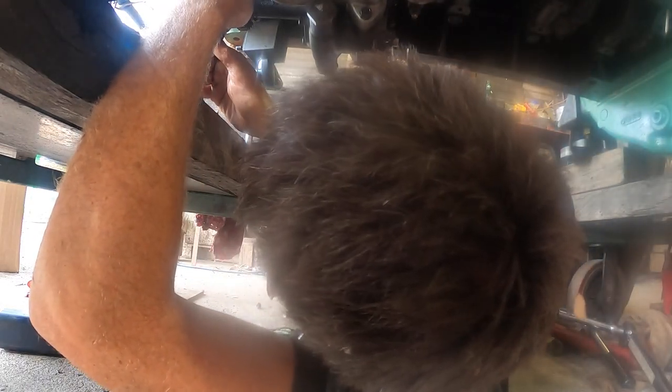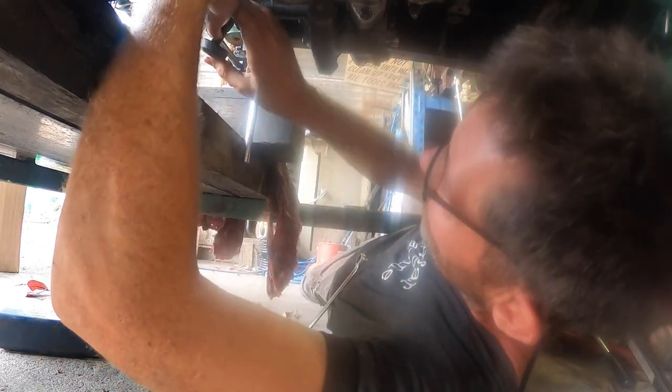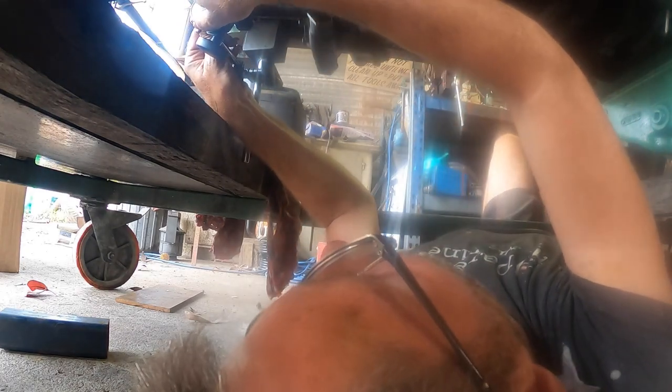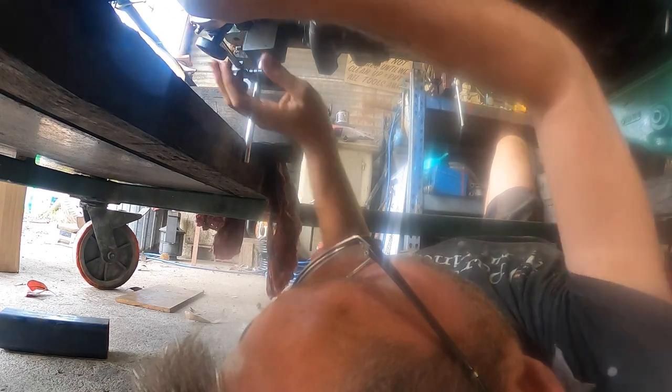And look, some people just put lots of shims under there. Yeah, it's got clearance, that'll do. And look, the gear's not going to slip. But let's not make the gear train any noisier than it really needs to be. Exactly. It will just cause premature wear.